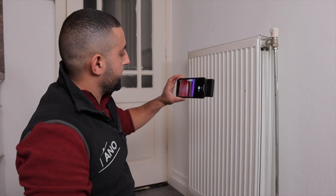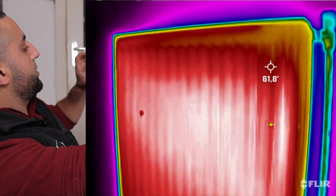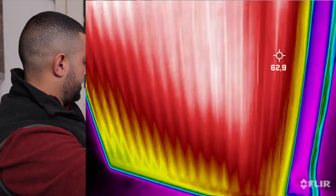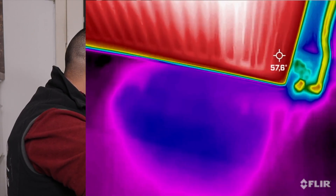Don't mind this radiator here — actually, it's poorly connected, but I want to help you guys because every bit helps. Let's take a look. Wow, this radiator is roaring — not normal. It comes in with 60 degrees Celsius and goes out with 60 degrees Celsius, not normal. This is everything but well regulated.